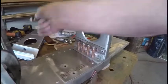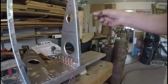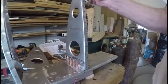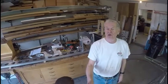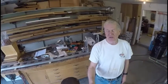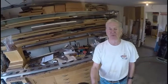Of course, there will eventually be rivets to hold on this one nose rib. This is pretty flimsy stuff — you'd say a beer can isn't a whole lot thinner — but once the flanges are on and the reinforcements and everything are riveted together, it becomes quite stiff, and that's what's going to hold us up. I only have eight more nose ribs to put on this side, and nine trailing ribs to install on the other side, and then of course we'll go to the left wing.